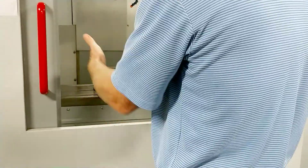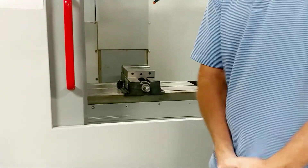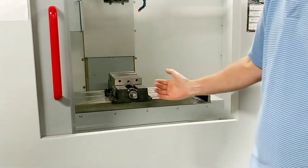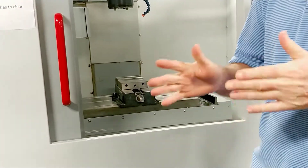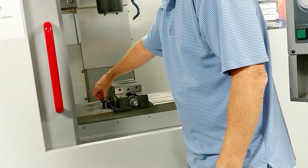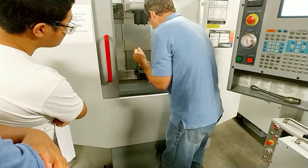The first thing I do is I just look at it and I try to get it square — I've actually been spot on a few times. At work I have a large vise square. I would actually take a large vise square, bump it up against a T-slot or my table, and I can get it kind of close with that. It's not going to be exact, but it's going to help me get close to where I want to be. Lining up the vises: I'm going to take one bolt on one side and I want to tighten it a little bit — not super tight, but definitely snug.